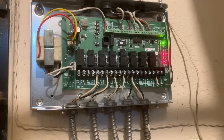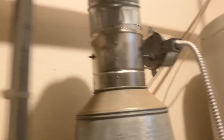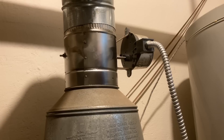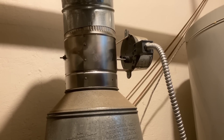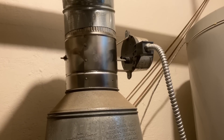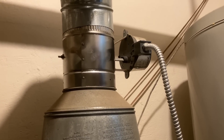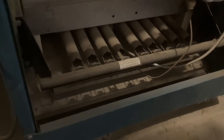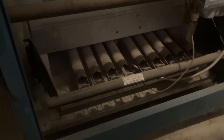A green light - we have two zones, we have a damper closing and now it's going to open. Click of the relay on the gas valve - ignition! Voilà - Houston, we have ignition. Burnham Series Independent 206, 164,000 BTUs gross input, manufacture date July 2008.